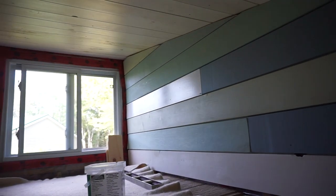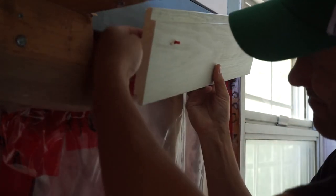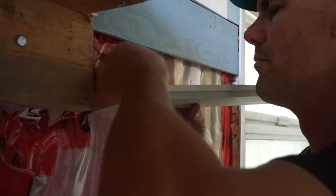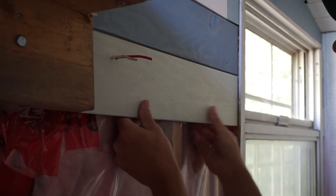You can go longer or you can go shorter — it depends on how you want to do it. The wall is 12 feet wide, so what we are trying to do is have pieces that are long enough to go all the way to the end of the wall. You don't want multiple exposed pieces, because if you have to make a cut where it's not on stud, you're going to have an exposed piece of wood where you don't necessarily want it.